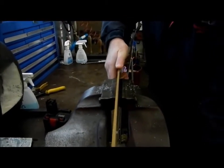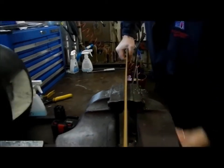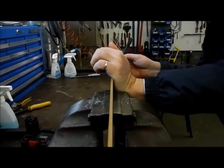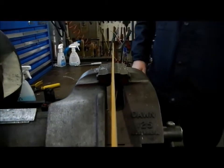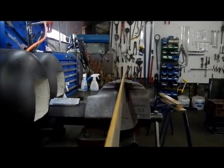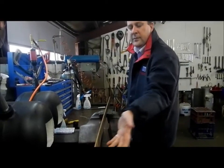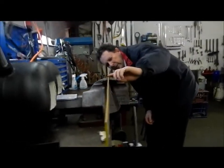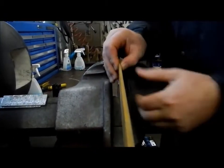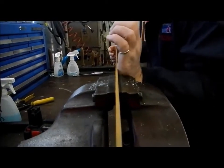All I do is just keep progressing through the vise. Shooting down that now — hopefully you can see that's pretty bloody straight. Sometimes you end up with a little bit of a bow in it, so you find out where that is. There's a bit of a bend about there, and we'll just move that up in the vise. Just make sure we're in the right spot — I just over-bent it a bit there.